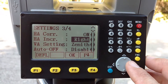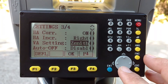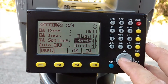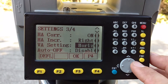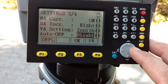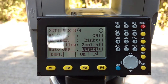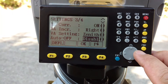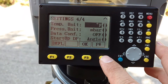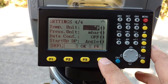Horizontal angle is to the right — we talked about that. Here's another option: this is your boot-up default vertical angle. I've got it set to Zenith. We talked about the horizon — that's zero when you set it to zero at 90 degrees off your plumb — and slope percentage is the other name. Auto-off: I prefer to turn my gun off when I want to because I don't like the boot time. So I disable this, but if you enable it, it's going to turn off after a certain amount of time.